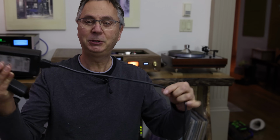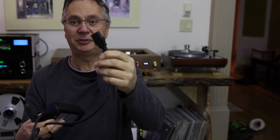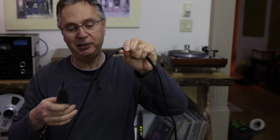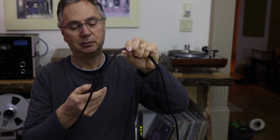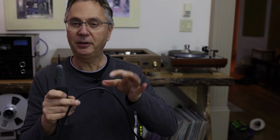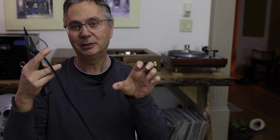So we're going to compare 2 cables. Your regular cables that sometimes come with your DAC or CD player. This one is a regular cable, and we're going to plug it into something that is at least doing something. In this case, we're just looking at the cable, not the actual power supply. Because this is not shielded, if you have other sensitive line inputs, say coming from your phono stage really close to a power cable like this, you're probably going to get some noise coming from it. So it's always good to keep your power cords away from interconnects and make sure you have a little bit of distance. Even better if you can get shielded cables.